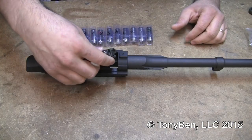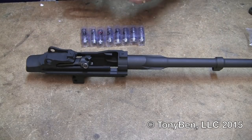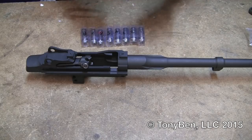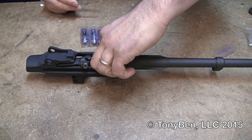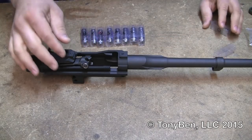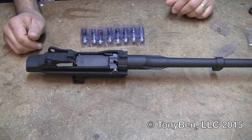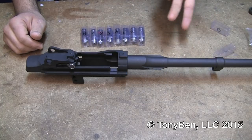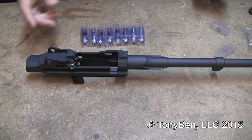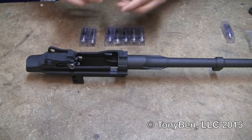You're going to get your strip bolt and place it in the receiver. First, get your 1.630 headspace gauge and slide it in. We're going to make sure that the bolt actually closes. This is the minimum headspace. If your bolt won't close on this freely, there's problems. But right here we can see it closes no problem. It just swallows it, and that's what we want, because I'll show you the formula in a little bit. Then the next thing we're going to do is see if it closes on a no-go gauge.